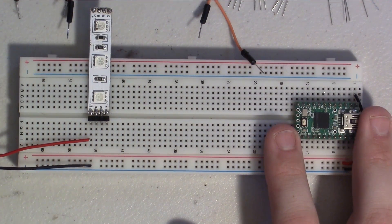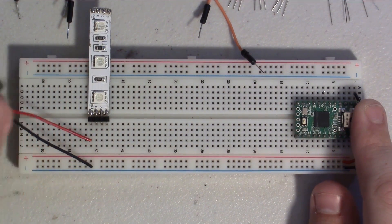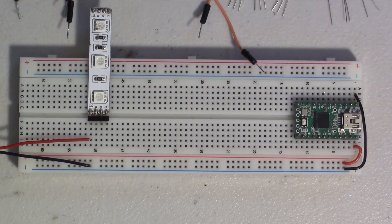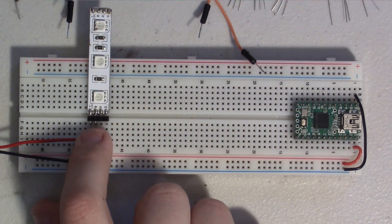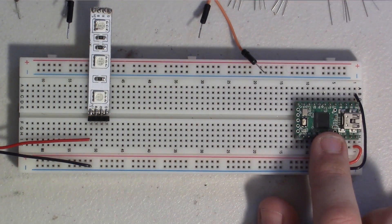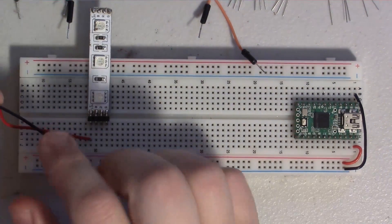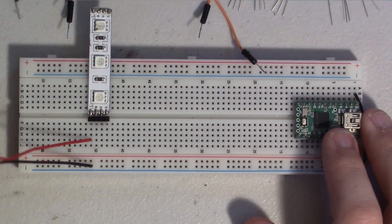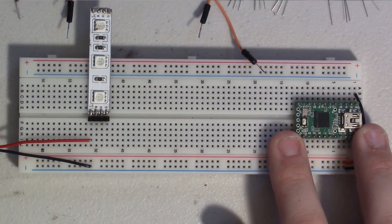In this video I'll show the basic wiring — the Arduino will be USB powered while the strip runs on 12 volts, so you'll have two power sources. It's not the most elegant solution, but it works. On many Arduinos like the Uno, the barrel jack voltage input can handle up to 18 or 20 volts, so you could power everything from one supply. This particular Arduino only accepts 5 volts.